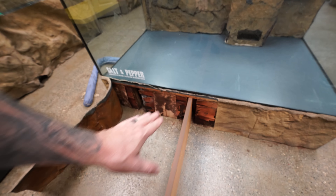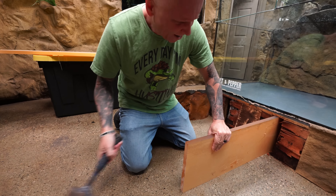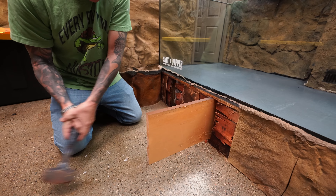My buddy Steve Bashi actually cut these acrylic pieces, which are literally just as hard as steel. Basically we have them wedged right here and I've got to hammer them in a little bit. What we're trying to do is make sure that this bottom piece right here is elevated as much as it possibly can, because the wood is rotting away, which is causing drag on it and actually pulling the seam apart. These are cut a little bit oversized so that we have a lot of pressure. I'm going to have to hammer it. So far it's going good - probably going to get more difficult the deeper it gets.